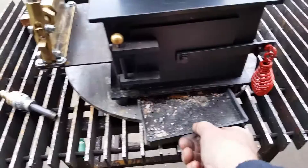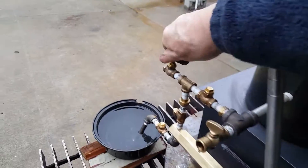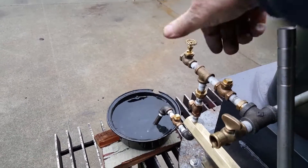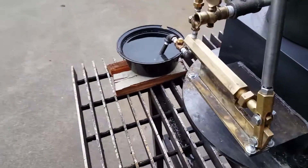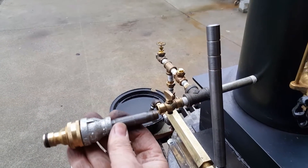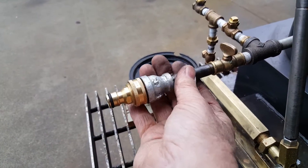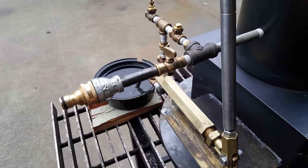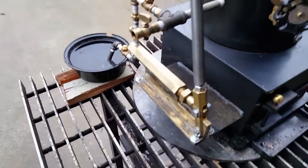There's a little ash pan here, and a hand pump that I built. Air lock valve here — you got water coming out of there, you know it's pumping. Everything goes into the boiler. This is a drain and fill right here. You just plug your hose on the end of it — it screws right in here. Just open that valve to blow down the boiler. You don't need it on there at that time, but to fill it at least.